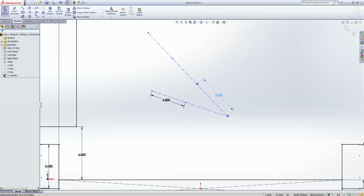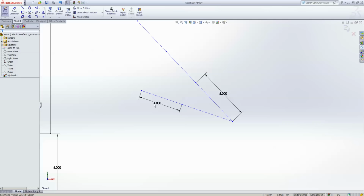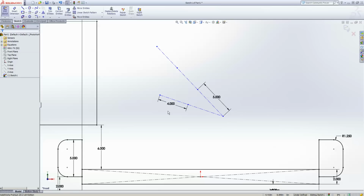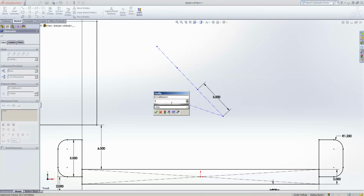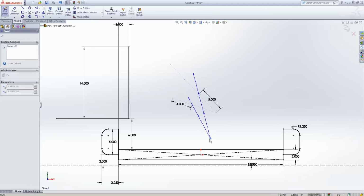And what's clean about this is now you have 2 parameters to control, and you could even put this in a design sheet and drive these dimensions. This is a function of your clevis and your cylinder diameter. As you go to the next cylinder diameter, this will get longer because things get bigger, and this is a function of stroke. So you can more quickly iterate your cylinders. This is a trick I learned after I did this whole process, and it saved me a lot of time, because now you can change a 7-inch stroke cylinder with the minimum number of dimensions, and you don't have to do mental math and go, oh, it's 3.96 plus 0.75 plus 7. No, you just got this.